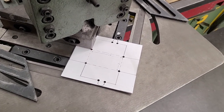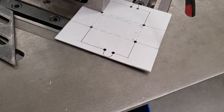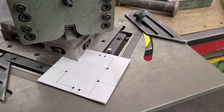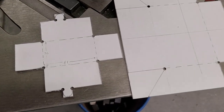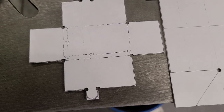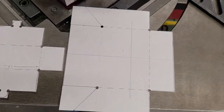Okay, we're lucky to have a little 4-ton hand notcher right here, and this makes cutting the inside corners really quite simple, although you do need to give it a good tug every now and then. So we'll, okay, 2-hand job. As you can see, the little holes that we've punched on there help to get everything lined up and make sure that your corners don't end up with any sharp little indentations on them. You'll also notice that we've cleverly placed a bucket right underneath the hand notcher to catch all the pieces that fall off. Remember not to leave a mess behind.